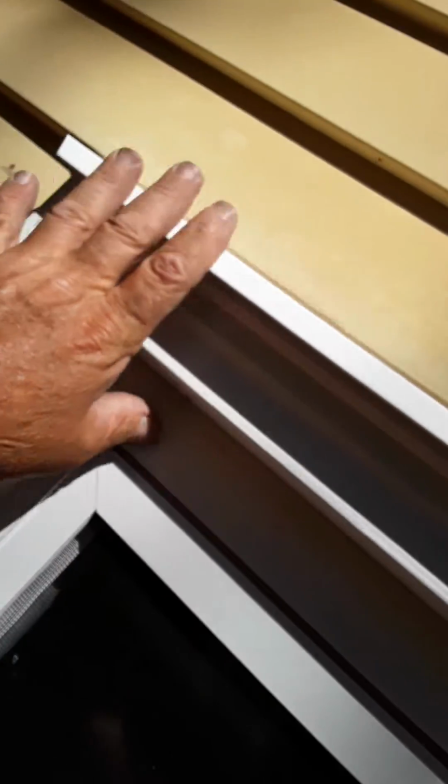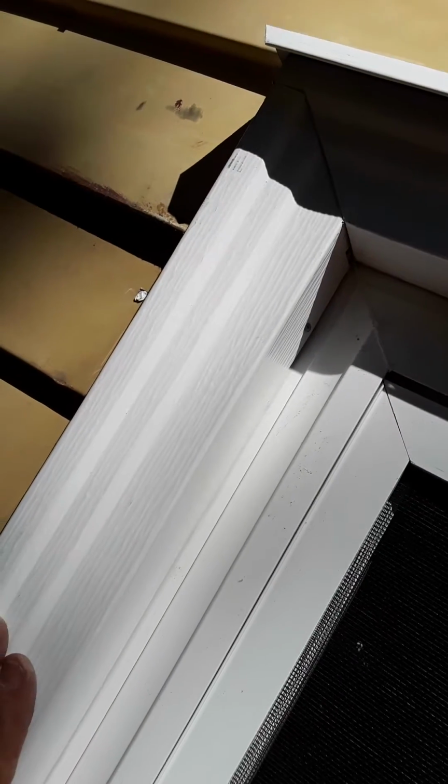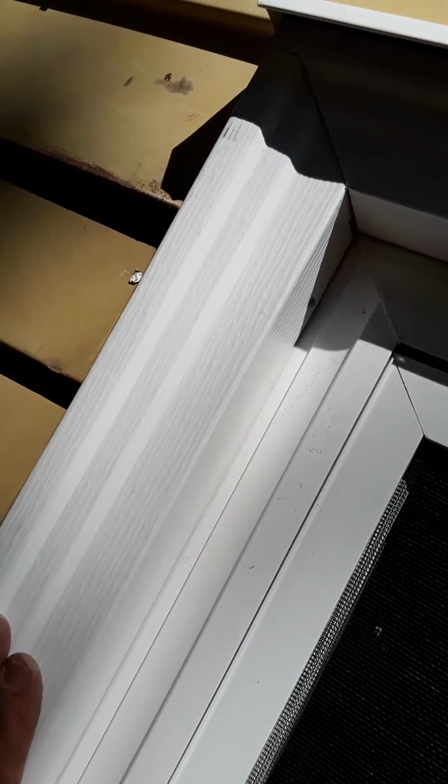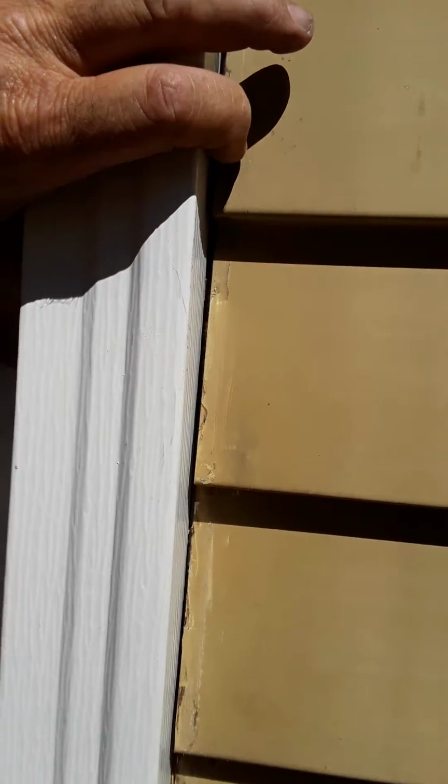So this drip cap, there's no flanges on these windows or anything, or any kind of window seal or tape or none of that stuff. This is just brick molding on top of gyplap, and then the siding is old-time aluminum siding, but it looks good compared to today's lumpy heavy seam vinyl. Anyway, that's what they did. They just put it up, and then you caulk this gap in between.